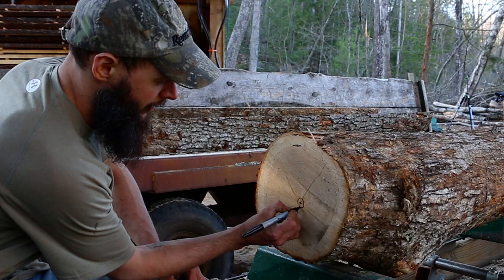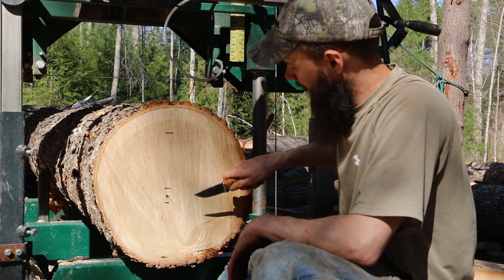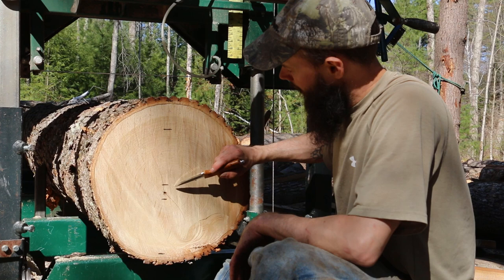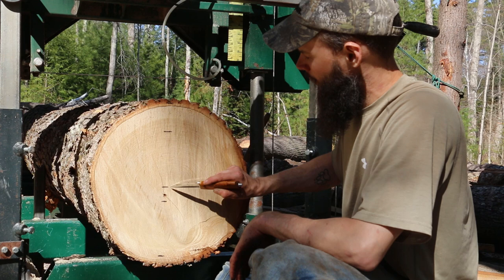You can see it's already kind of falling apart in there, but this heartwood over here - I can't pull it up, it's really really hard. So what I've done is marked out my cuts - we're going to be just above and just below the pith. Out of this one board here, we'll box out the pith later and throw that away - throw it in the wood stove. To the right and the left of the pith, I'll have great quarter-sawn lumber. It'll be a nice one-inch board.